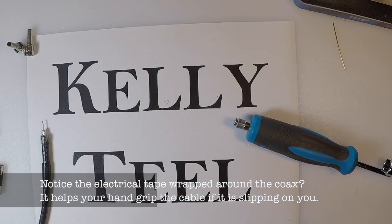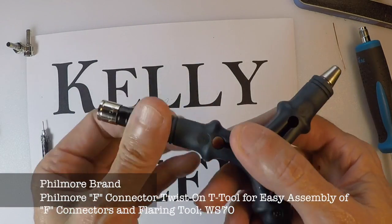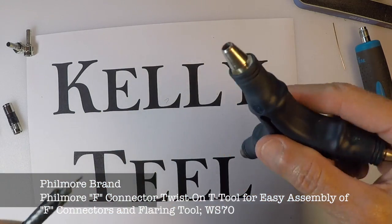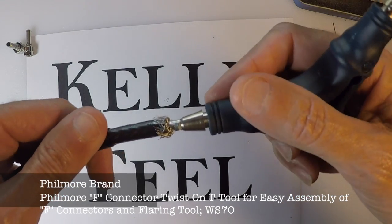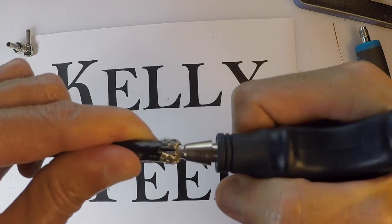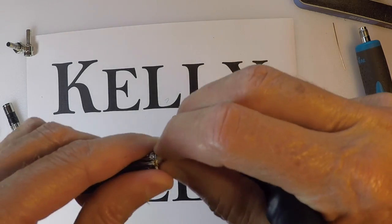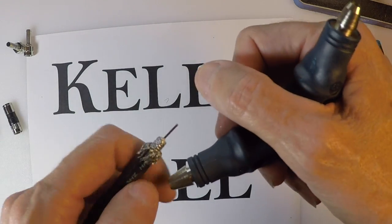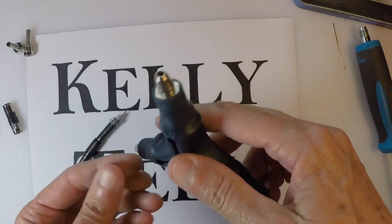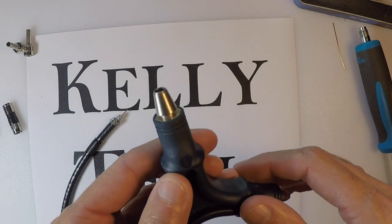I've also just real quick put a band of electrical tape — it helps you push it if you need to. Then I have another little tool — you can screw an F connector onto it. I bought it because it's supposed to be a flaring tool, supposed to go on here and flare the end of the wire casing, but it's too small and when it does get there it just flares a little ways — not too desirable. This smaller one I think is for RG-59; this one is for RG-6, but it doesn't work.